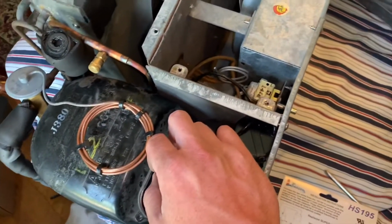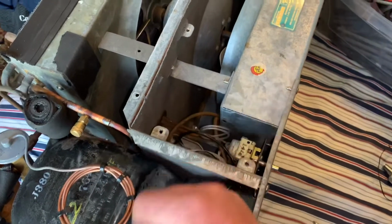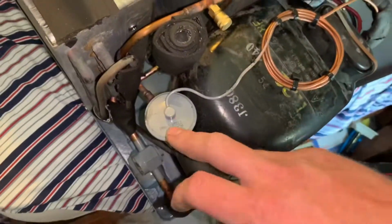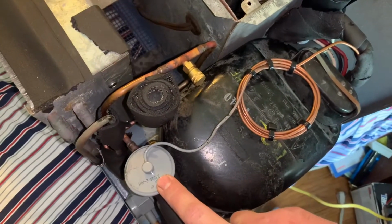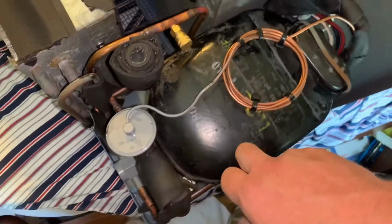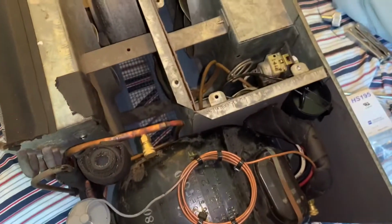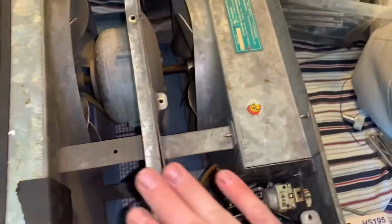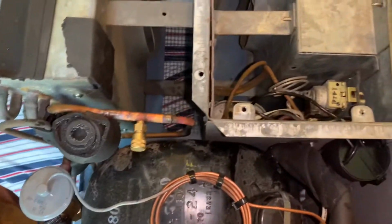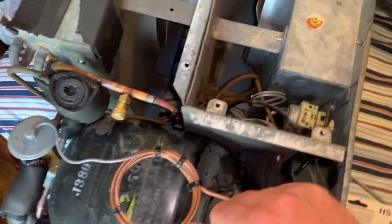And yes, that's frankly sitting on my bed in my bedroom because I didn't feel like dragging this damn thing back down to my garage just to do this. And the reason for that is I didn't have this issue on my Fedders with the weather wheel that I did the TXV on. It always restarted without a problem. This one, and the air conditioner guys, Philco, will not restart even if it sits for, in my case, 10-15 minutes. It will not bleed off enough pressure. It has to sit overnight. So that's the whole reasoning behind that.